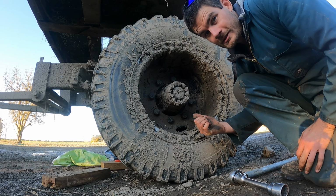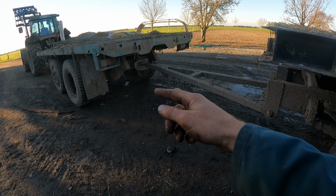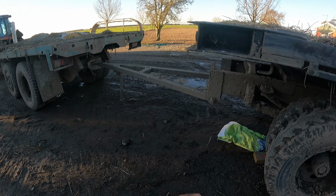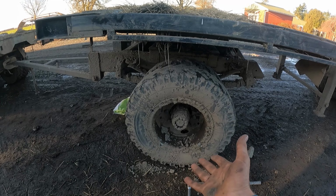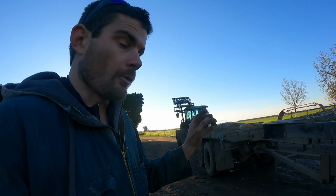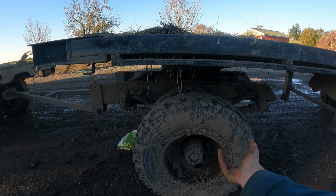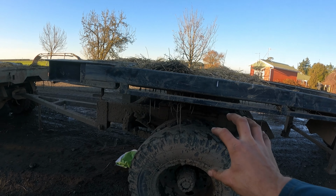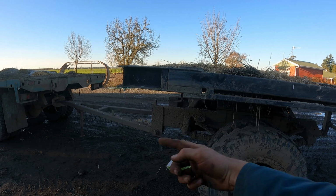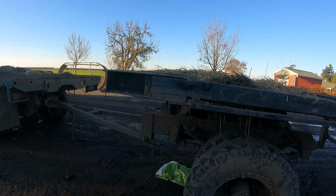They're bloody backwards. So the wheel is rotating anti-clockwise when the trailer is moving forward. Now of course if they were a normal thread stud, they would effectively undo, or have the risk of undoing. By putting the nuts on backwards, they're effectively trying to tighten as they drive down the road and not loosen as they drive down the road. Just wish someone wrote it down somewhere.